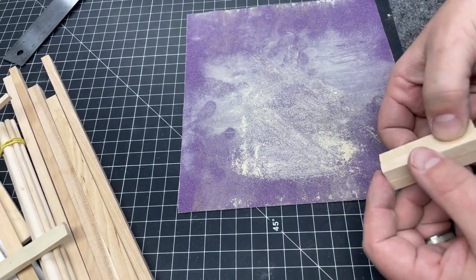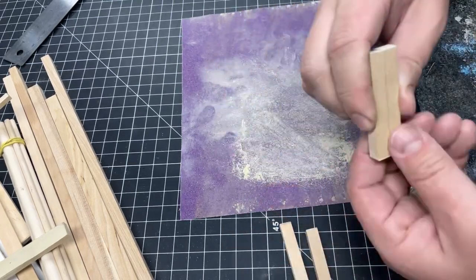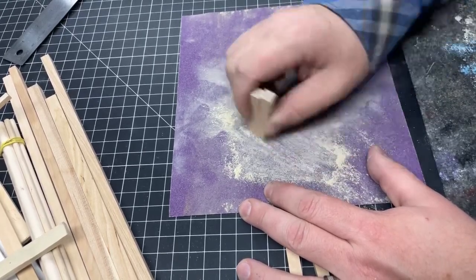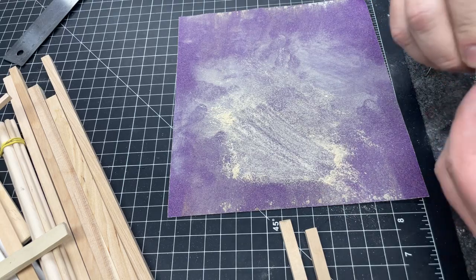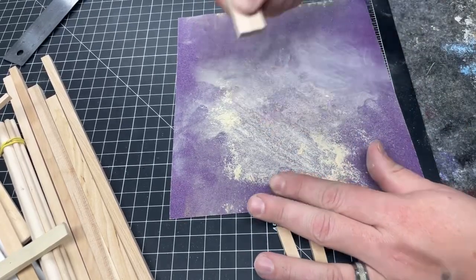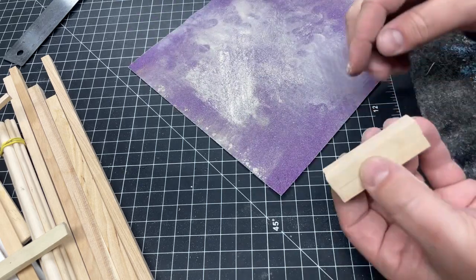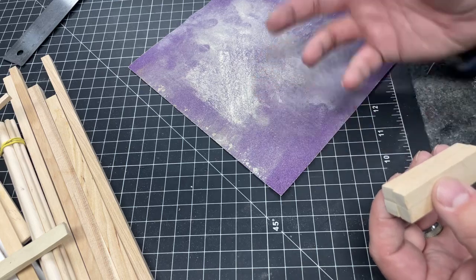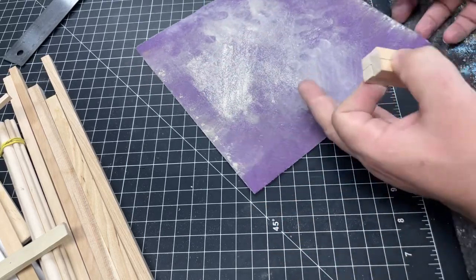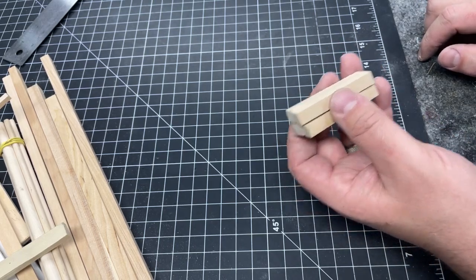These, I'm going to size down. These are a little bit tall here. But what these are now, they're even enough to where I can glue them to the bottom of the table. And then we let them dry and flip it over and sand the whole table down at the same time, and then all the legs can be even and there's no wobble in them. So again, you could spend the time to cut these a little bit slower, get them more accurate, do less sanding. That's a good practice. I'm just trying to get this done for y'all so you can see it here.